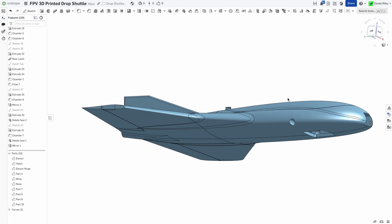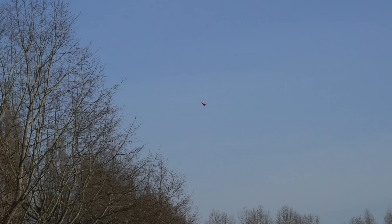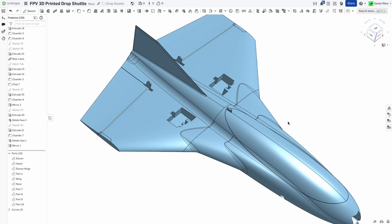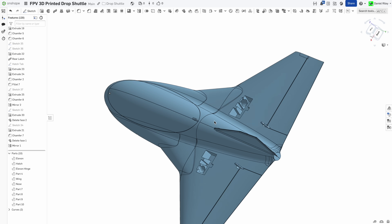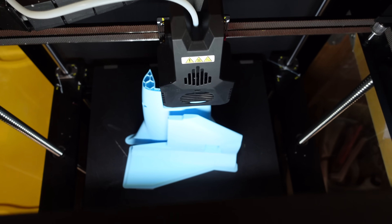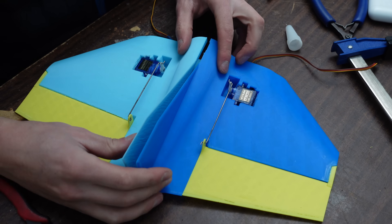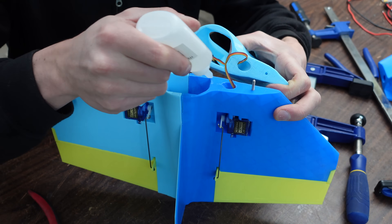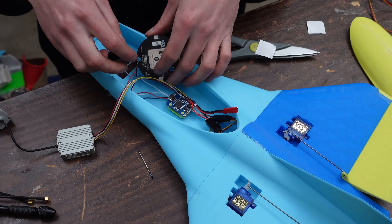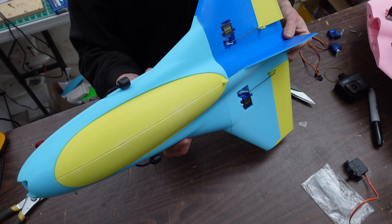I wanted to try out this autopilot flare mode on an airplane that's a little less floaty and forgiving than the foam board space shuttle. So I hopped back into Onshape and designed this — an enlarged version of the 3D printed shuttle-type glider from my solid wood airplane video, where it flew really well and the natural weight distribution gave the perfect center of gravity. I enlarged it, made control surfaces, and added a cavity inside for all the electronics. This design is also available at the link in the description. I printed all the parts out of normal PLA first because I wanted it to be heavy — making it super lightweight would kind of defeat the purpose. The elevons were held in place with little pieces of steel wire, and the plane prints in three main sections glued together with alignment pins. I'm using a little Omnibus F4 flight controller to run Sebastian's custom code, and also added a DJI FPV system to pilot the plane from a first-person perspective.